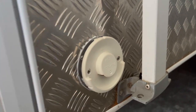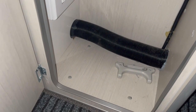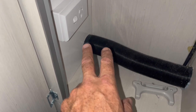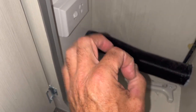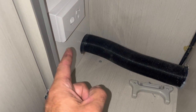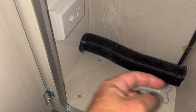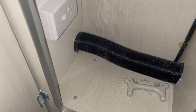So this is where we decided to install it, and I'll show you how it goes through the cupboard. So just inside the cupboard, that's the ducting that's come through. It's actually got two tubes — the outer tube where air gets sucked in to make the combustion, and then a smaller inner tube that goes out which carries the hot exhaust air. As the cool air comes in, it's cooling the inner tube which has the hot air, so it's pretty safe — not really hot to touch.